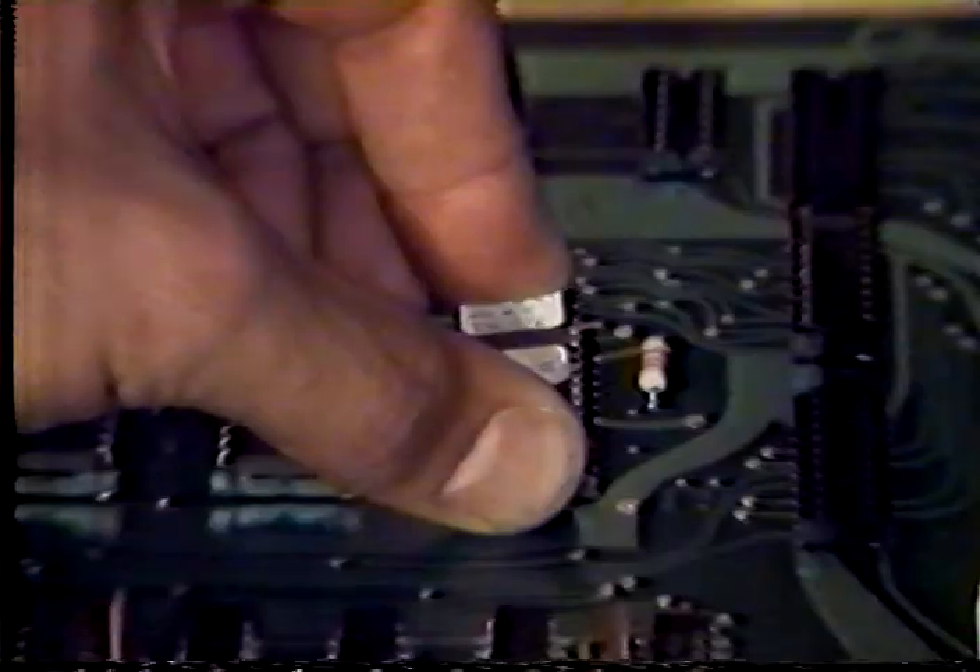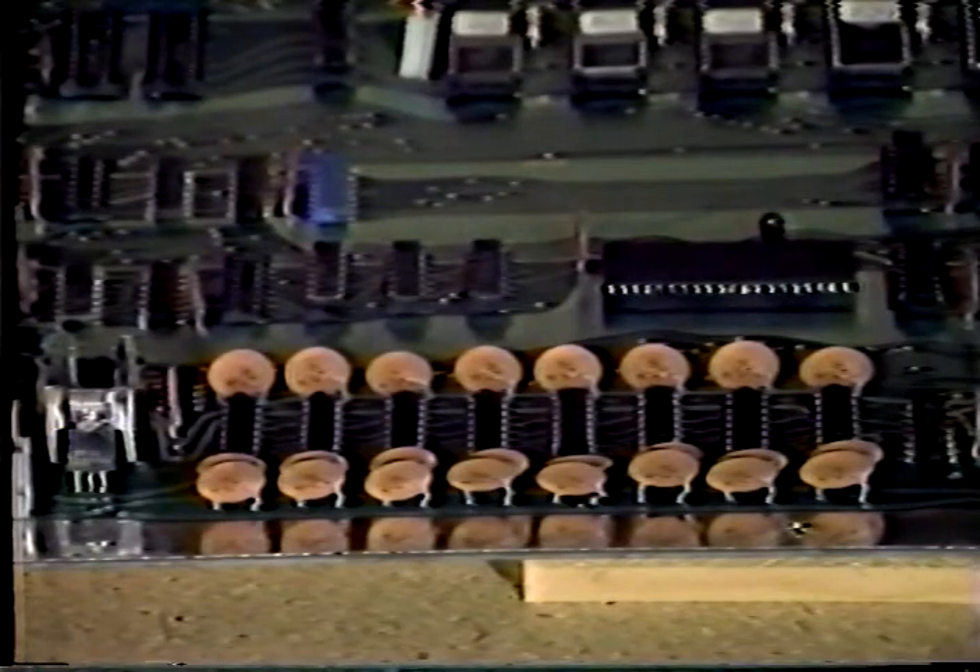Turn off the game again and plug in the PROM test. As you can see, this test shows at a glance that all game EPROMs are okay. If any were bad, the word 'bad' would appear next to that PROM number. Finally, the RAM test quickly checks all eight RAM chips, letting you know immediately if the memory is okay and telling you the position of any bad RAMs. With these four test PROMs, checking your game can be fast and simple, and they're a great time saver since all the tests can be done right on location.